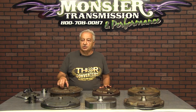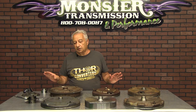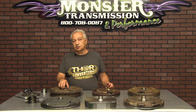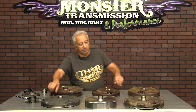We get the question all the time: can I turn this down to fit my crankshaft? If it's a standard crankshaft, there's no way you need to turn it down. Occasionally we run into these oddball crankshafts that are aftermarket — they're steel cranks and the size is slightly different.